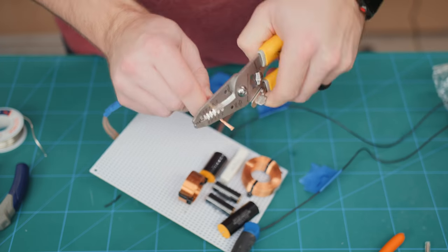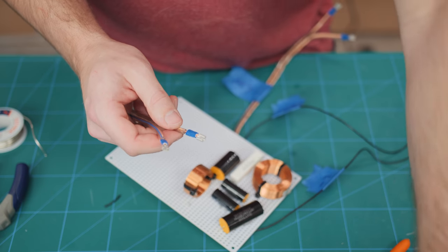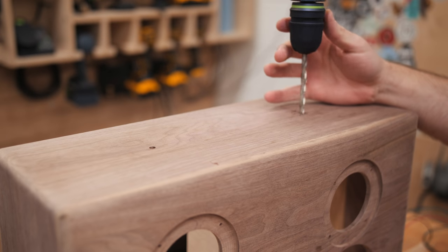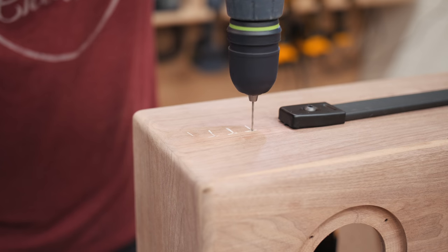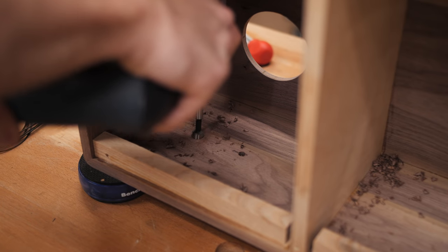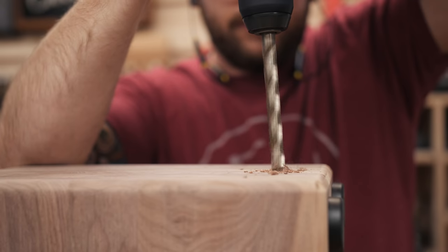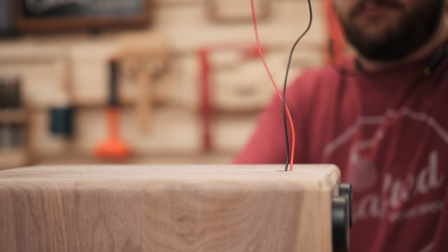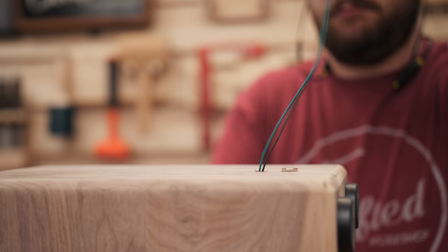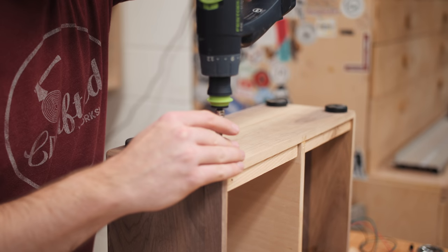After soldering the power jack to the leads from the amp board, I stripped the ends of the speaker wire and added crimp connectors to easily connect the speaker wire to the speakers. With all the wiring complete, I could move on to adding holes for the various ports, LEDs, switches, and the carrying handle. This was one of the more tedious parts of the build, as many components had different-sized posts, so I had to use a caliper to find the correct drill bit size. I also needed to use a Forstner bit on the inside of the cabinet to allow the components to feed through — most parts only had a threaded area of about a quarter-inch in length, so I had to recess those holes to allow the threaded areas to protrude through the cabinet. I also added rubber feet to the bottom to keep it from rattling when playing music.